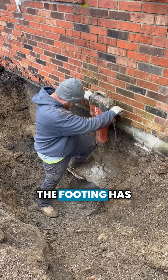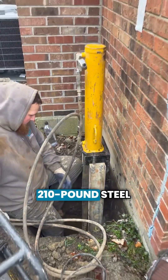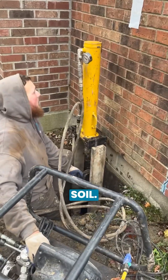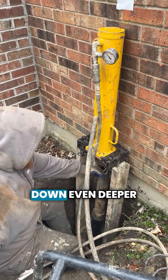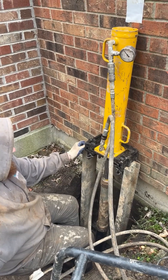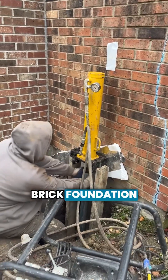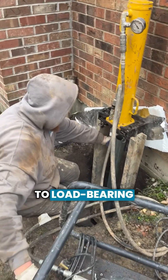The foxhole's been dug and the footing has been prepped. Now we're going to use this 210-pound steel hydraulic drive system and the ram to drive steel pipe down to load-bearing soil. Got Jeffrey here. We're going to use the stubby pipe to help drive it down even deeper for a full stroke. We set up a piece of foam insulation to prevent the ram from hitting the brick foundation while we drive our galvanized steel pipe down to load-bearing soil.